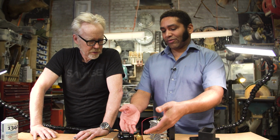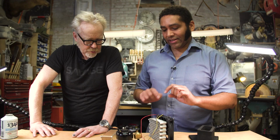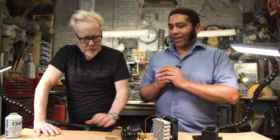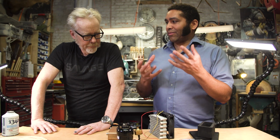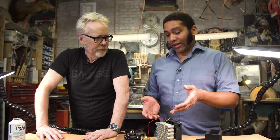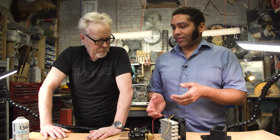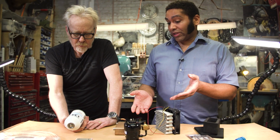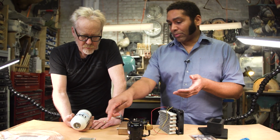Right. Since we have liquid coming out of the bottom of this heat exchanger, we want to boil that liquid off. And if you think about water in space, the vacuum of space is a low enough pressure that water will just boil off, and as it does, it will absorb heat. Right. This is the same thing. We have a pressure low enough that this substance here, which is our refrigerant, will boil at the pressures on the low pressure side of the system.